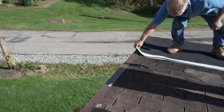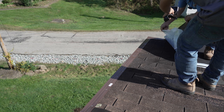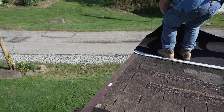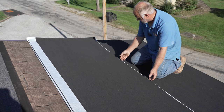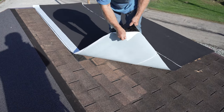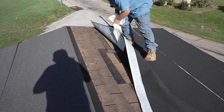Then you put your drip edge like this. I go at an angle, I got it all lined up. Now what you do is you take the bottom plastic off, take the other plastic off here - and that's it. That's how easy it is. So I got it lined up just like that. Remove the plastic - sometimes it doesn't move, it can be easy.